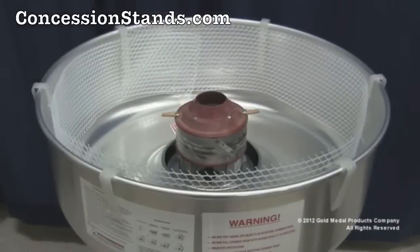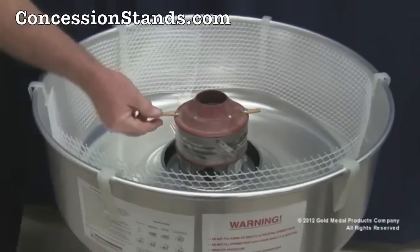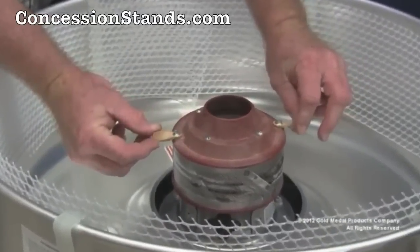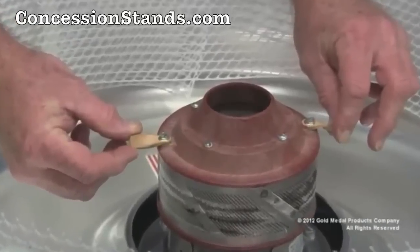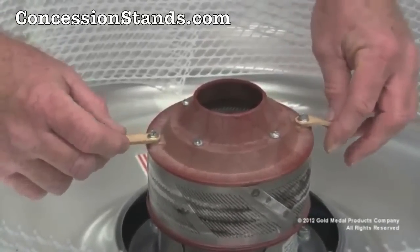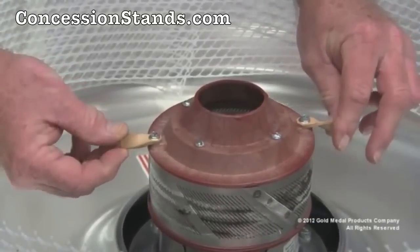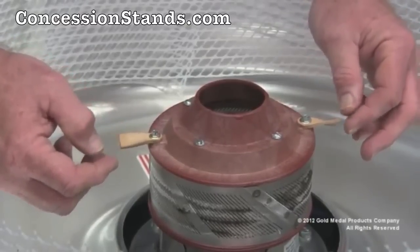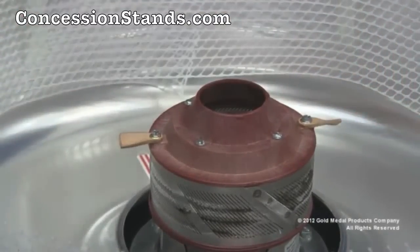Be certain to adjust the two leather floaters on the top of the spinner head before operating. Give each leather floater a twist so the leading edge of the floater is pointed downward in the direction the spinner head rotates, which is counterclockwise. Properly adjusted floaters will allow airflow in the pan, provide more lift to the floss, and it will collect higher on the outside wall of the pan.